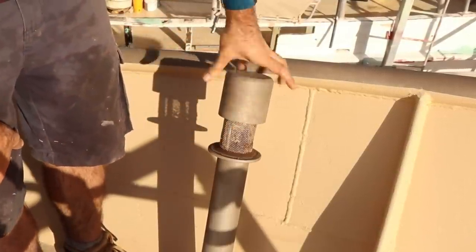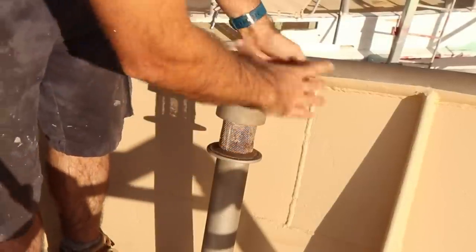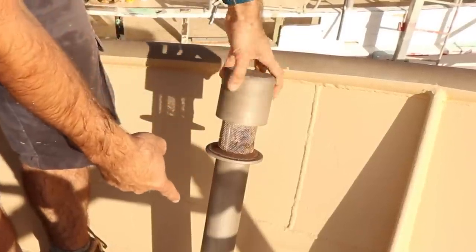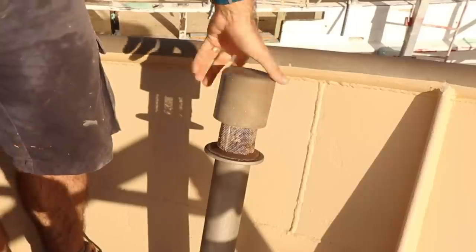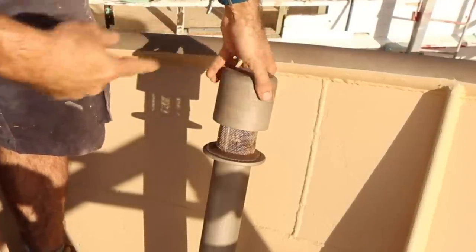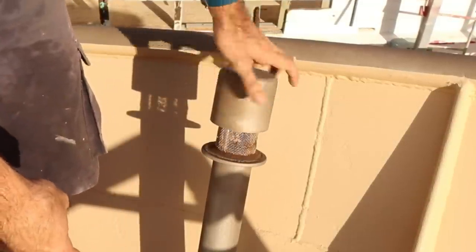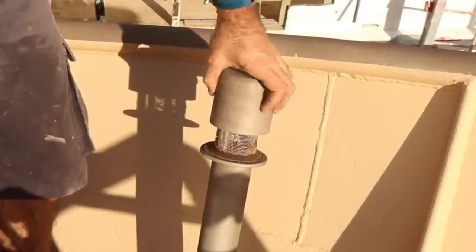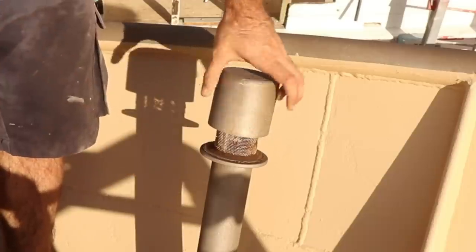And some of the old trawler guys gave us some hints about when we go to sea and we've got full tanks of fuel up the front, to put a plastic bag over and duct tape around here so that this will stop the surge in the tanks, but you will get seawater trying to go down into your tank. So doing that with a plastic bag basically eliminates seawater getting into your breathers. And then when you do need to transfer it, go up, open it up, transfer it, and then come back and close it and take these up again. Remember, these tanks up the front are storage, they're not running tanks. So most of the time they're sitting still, whether it's full or empty or whatever, and it's only when you choose to transfer it into the rear tanks at the back that anything happens with these breathers.